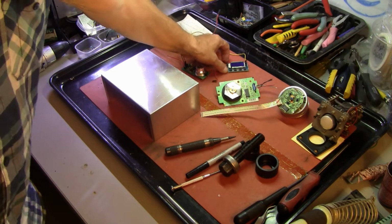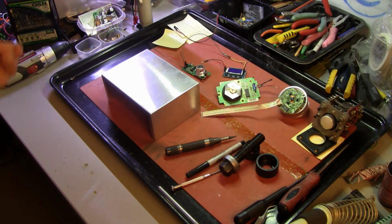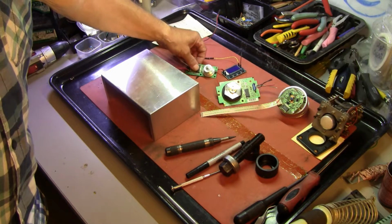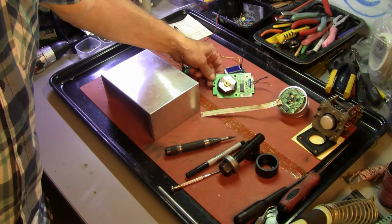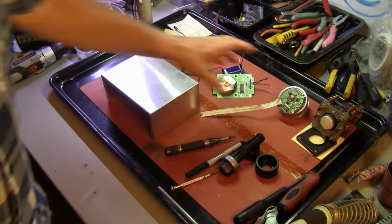So I bought a pulse width modulator on eBay. It has a variable frequency and variable pulse width. I have this motor running fairly reliably. This one, I believe I have the enable line floating. It will run, it will stop, it will run, it will stop.